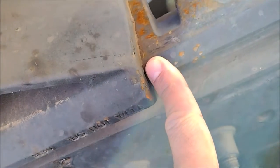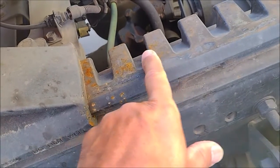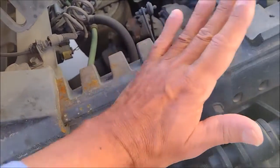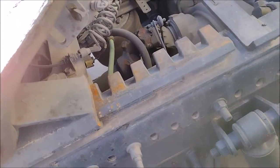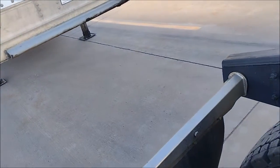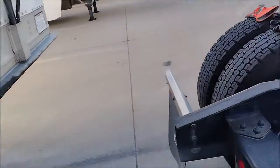Here it looks okay, it looks loose, but there is no rust. Here there is no rust. That surface is rough, which means one side can be slower than the other side, and the fifth wheel will be jammed in this direction, and you cannot release it. And when you pull or you brake on the highway, that trailer comes hitting you so hard or running away from you.